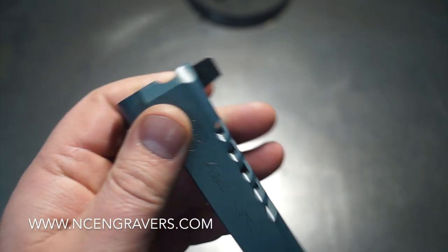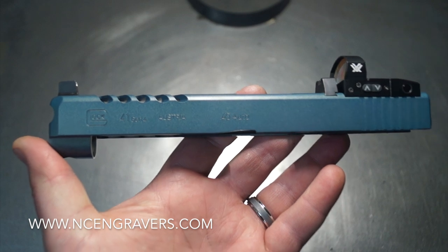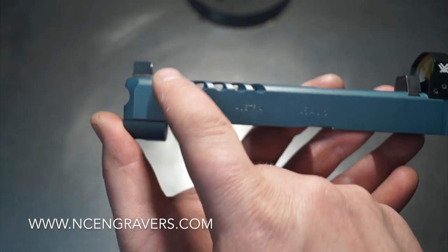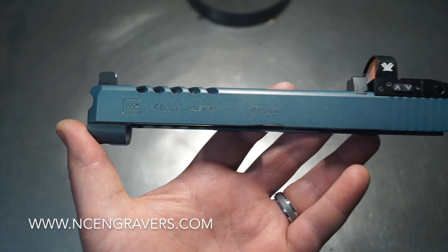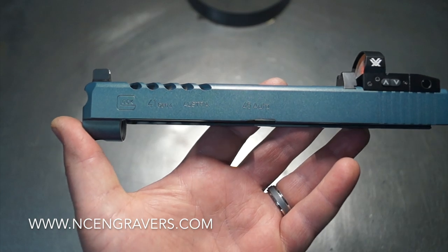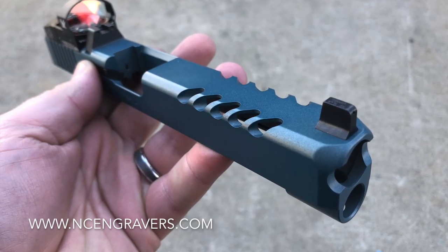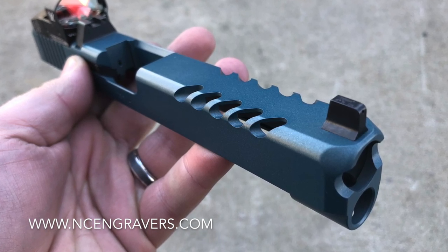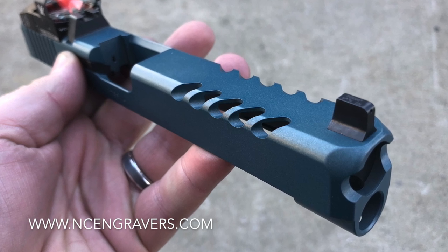Cobra nose on the front — really nice, but it ended up being a little bit more challenging than anticipated. This is a slightly different model, so the distance from the muzzle to the top is not always the same on every slide. Even when they are the same, the barrel has a different thickness because this is a .45 ACP, so the barrel is a larger diameter than what you'd get on a 19 or a 23. So it ends up being a challenge overall.